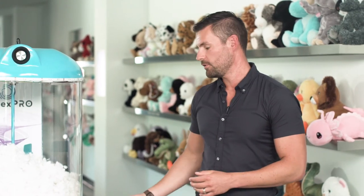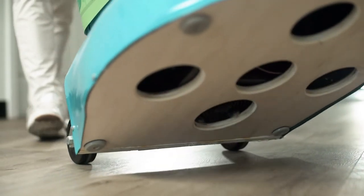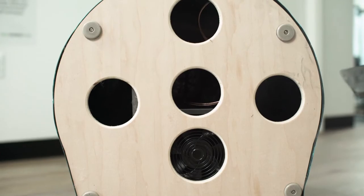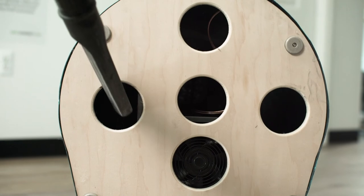To keep the inside of the machine clean and free of debris, we recommend doing this once or twice a year depending on how mobile you are and how many animals you're processing. Every six months, lay your machine down — there are notches on the bottom of the unit used to pull airflow into the machine. Take a nozzle attachment on a shop vac and slide it inside those holes to suck out any fiber or debris that has accumulated inside.